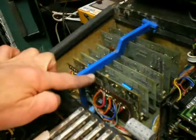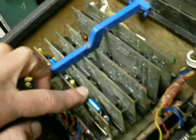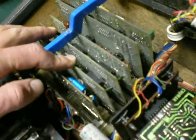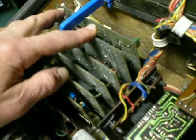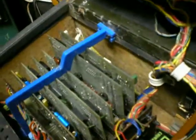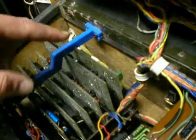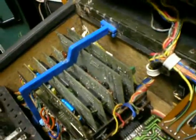Over here, this is kind of just a bridge card with some extra power supply caps on it. This is where the waveforms are actually generated, and you've got your tuning pots down there — the P435 board, I believe. The 434 board pair there, and that's the DAC board, and that is the key coder. This one actually is the one that receives the interface from the key bus for the monosynth part — it decides which keys have been hit and preconditions the signals. If you have a problem with just a missing note, it may be somewhere in the interface between there and here. If you have random notes, it's this one. If they're out of sequence, or you can get missing blocks of notes.